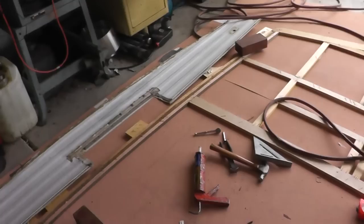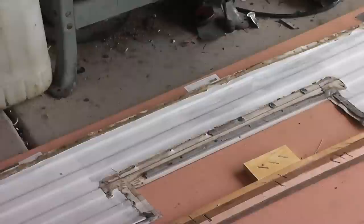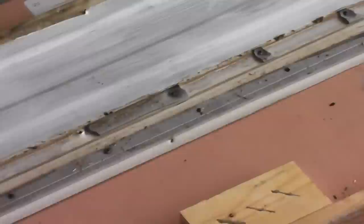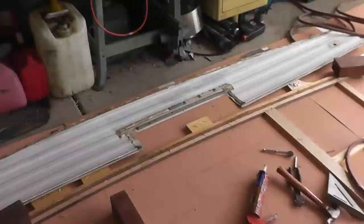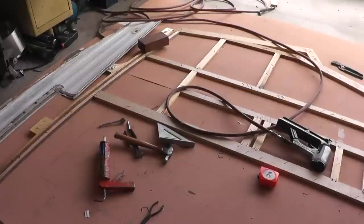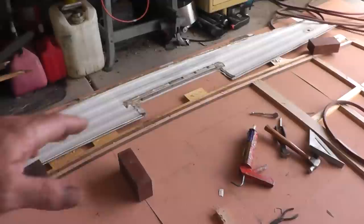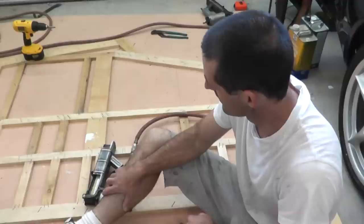But it was very bad for the structural integrity of the wall, specifically over the door, because there was very little shear strength right there. You can see evidence of this on the top piece of siding because there are cracks on each side of the door frame. In the new, improved, revised Jenny's Garage design, I'm going to eliminate this problem. Instead of having a piece of plywood terminate right here, I'm going to have a single piece start on one side of the door, go all the way over the top, and end on the other side, giving this area much more strength. Although this new design is much stronger, the disadvantages are more seams in the plywood and an extra sheet needed. However, the advantage of a much sturdier header area over the top of the door greatly outweighs these negatives.